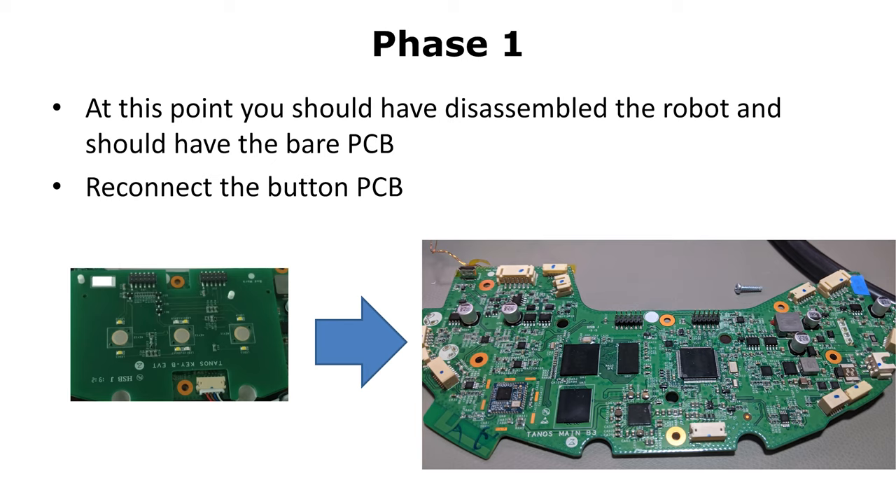You don't need to care about ground if you have a spare micro-USB cable and connect that to your computer. The solder method is more stable and more permanent — this is what I did to all my devices. Before you solder, you want to use tape as a strain relief. It's important that you don't pull on the cables because you might rip off the pads from the PCB.